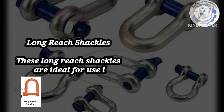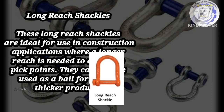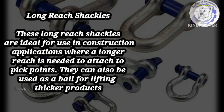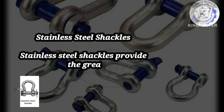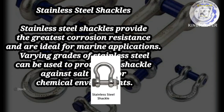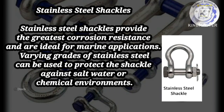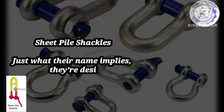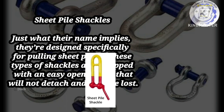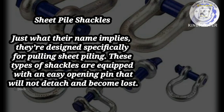Long reach shackles. These long reach shackles are ideal for use in construction applications where a longer reach is needed to attach to pick points. They can also be used as a bail for lifting thicker products. Stainless steel shackles. Stainless steel shackles provide the greatest corrosion resistance and are ideal for marine applications. Varying grades of stainless steel can be used to protect the shackle against salt water or chemical environments. Sheet pile shackles. Just what their name implies, they're designed specifically for pulling sheet piling. These types of shackles are equipped with an easy opening pin that will not detach and become lost.